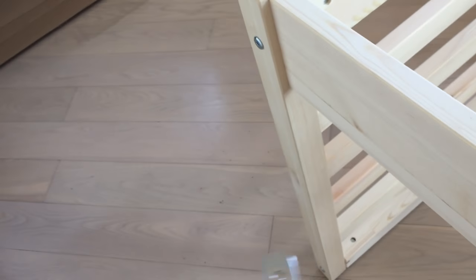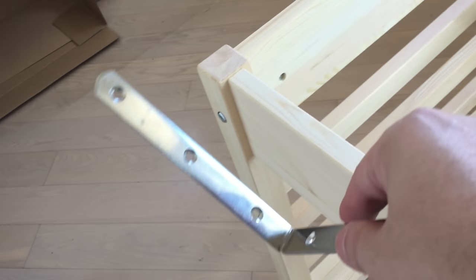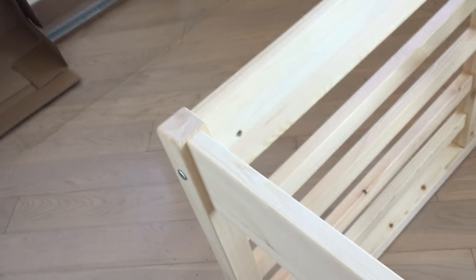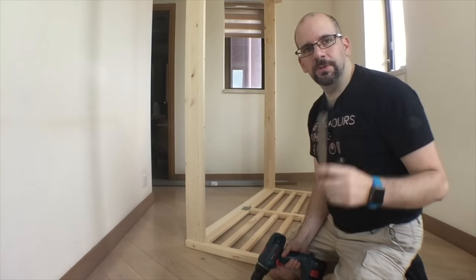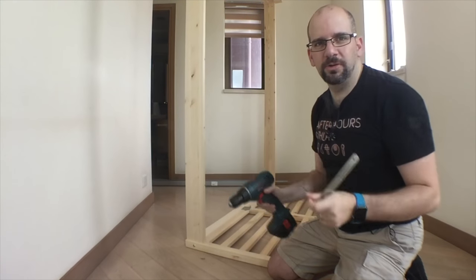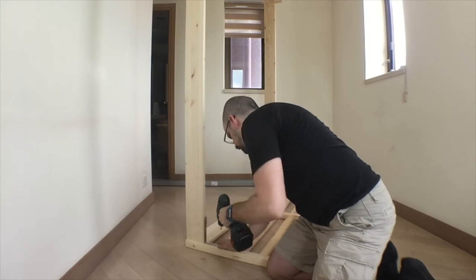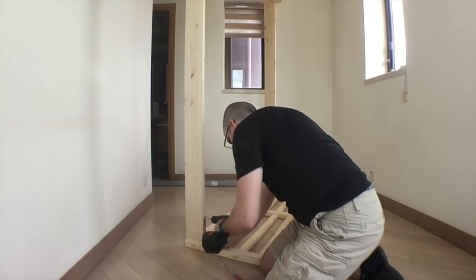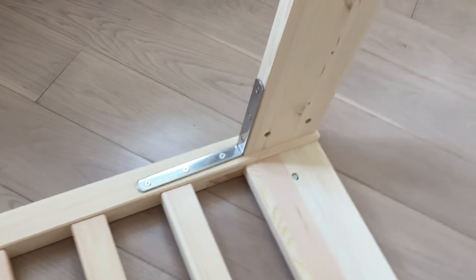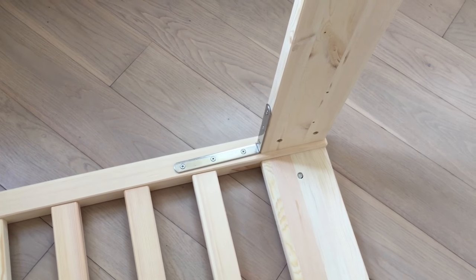Because it's such soft wood I could probably just drive the number eight screws straight in without drilling, but being a sound engineer I'm going to use a small drill to drill a couple of holes just to make sure it's done well. I've got my brackets — about three-quarter inch wide by six inches by six inches, and the leg is seven-eighths wide, so it's a little narrow but not critical to get it exactly centered. Just don't go off the edge and you should be fine. With the brackets installed — super easy, even if not perfectly straight — I now feel safe jumping in and out of bed without fear of breaking it.